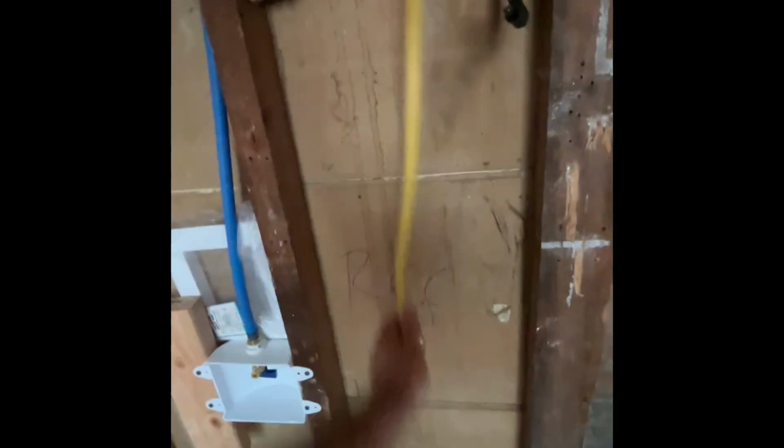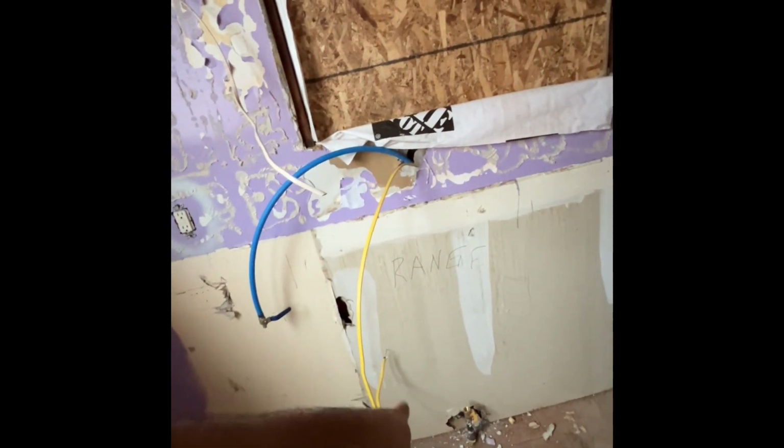This is the independent dishwasher line. So I just run an outlet somewhere right here for the dishwasher. This is dedicated refrigeration line. So outlet right there. This one is going to be, I need spliced, and it's going to be used for the microwave and for the stove. So an outlet somewhere right around there for the stove, and just leave this line free for the microwave.